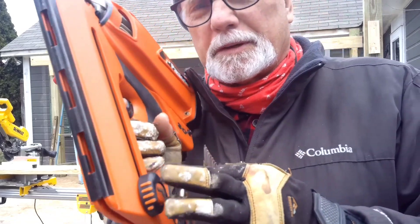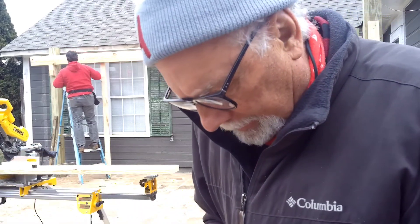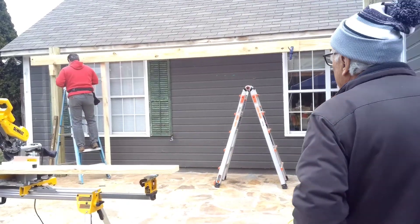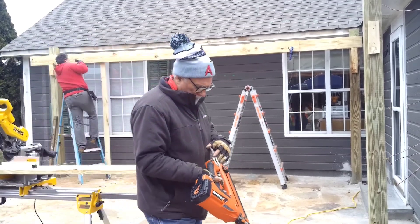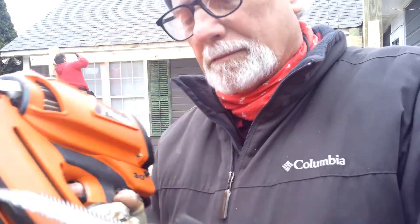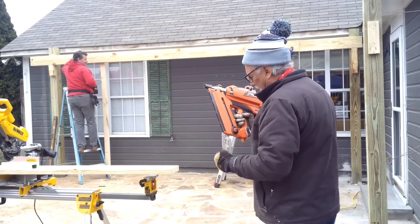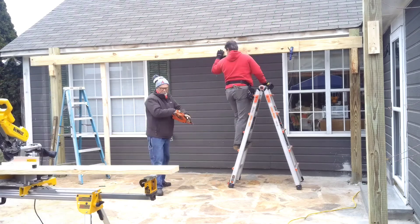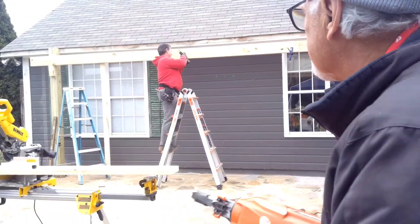Back to the Paslode — this is a framer that uses framing nails. They go in the bottom like so, slide down, then you put another one in and hit the switch to lock them. You load them at a 30-degree angle — you've got to match the angle when you load the nails in. After I put the battery in, you want to make sure she's blinking green.